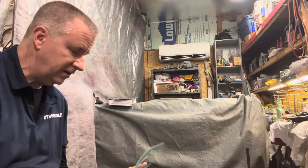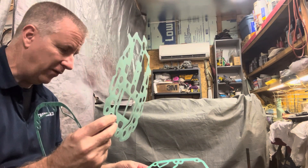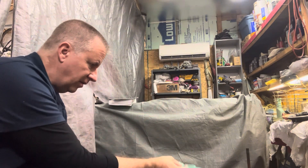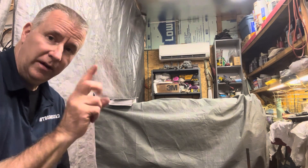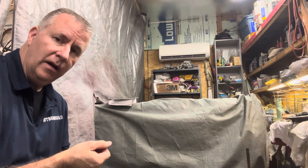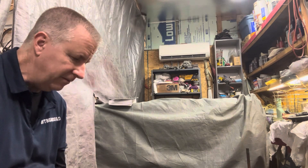It looks like they shipped three gaskets with this kit. We've got the base gasket, we've got that crusty one we took out first at the top, and then there's the one that goes down on the power head itself. The base gasket is the large one that goes over where that exhaust plate was loose and had a crack in it, so we're going to fix that up. It looks like we've got the gaskets we need. Now we've just got some more cleaning to do and a little drilling — two bolts broke. The one stud I think we can probably get out — we'll get that in the vise, juice it up, let it sit overnight, and heat it with the torch. The other one right next to the motor mount I don't want to heat because it's a rubber motor mount, so I'm just going to drill that, helicoil it, and put a new bolt in there.